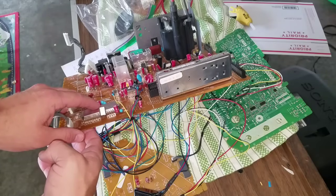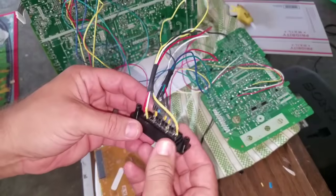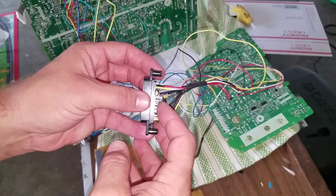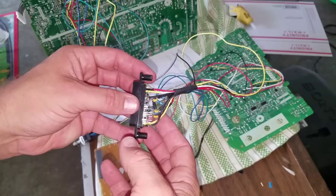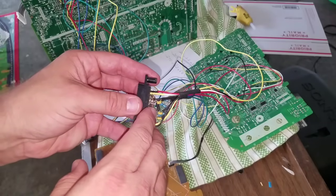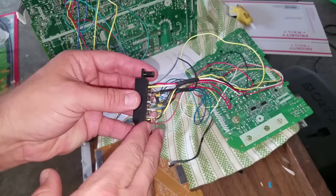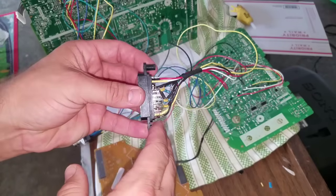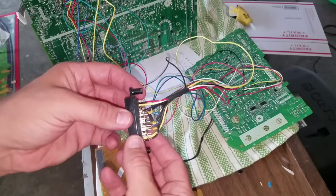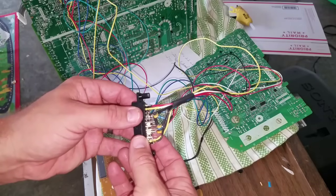Let's go ahead and look at some of the parts a little bit closer — starting with the SCART connector. This was something I had to come up with on my own for this design, but from notes from shmups, I saw that on this television it's best to attenuate a ground on each color line with a 75-ohm resistor, and then there is a capacitor on each color line of 0.1 microfarads. I've got my ground looped around, audio tied in, as well as my composite sync. The ground line is separated — the regular ground line and the attenuated ground line run to another spot on a chip to try to eliminate possible video clarity problems.